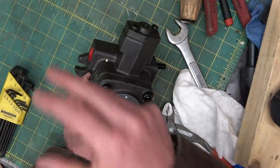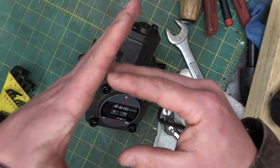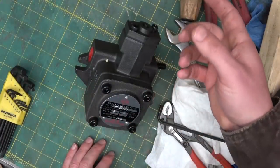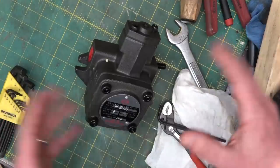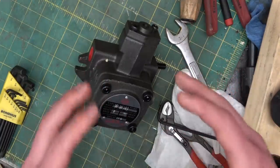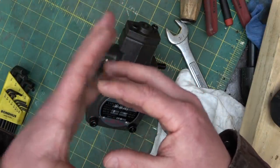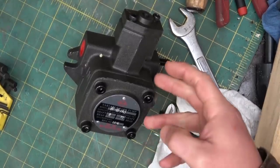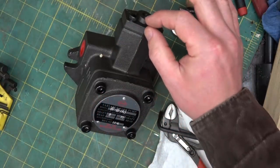The variable displacement piston pump is very interesting because it's like a six-shooter and it's got a swash plate. Depending on how far over that swash plate is, you get more or less flow. You can backfeed a signal into a servo — a servo is a motor with a control loop, whether it's electric or hydraulic or whatever. In the variable piston pump, you have a control loop called a compensator. That compensator reads the outlet pressure and changes the swash plate angle. It controls flow by monitoring pressure on the outlet side.